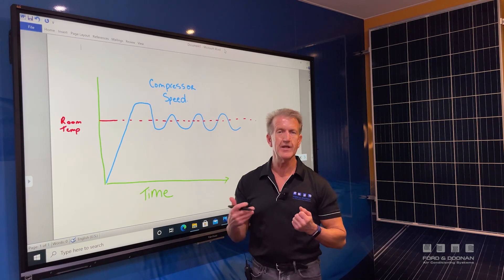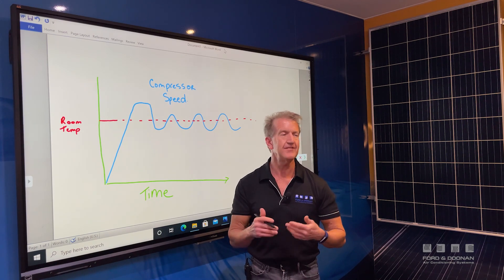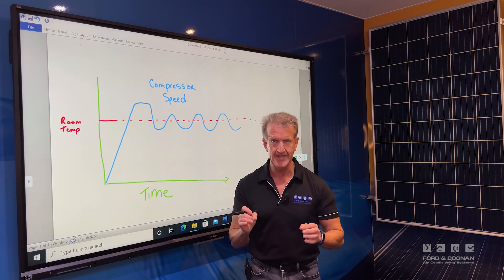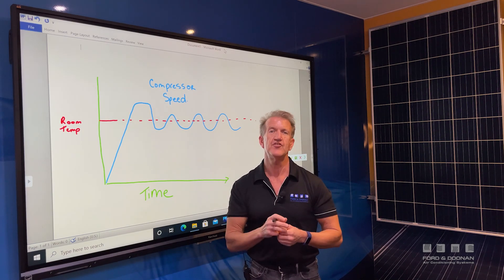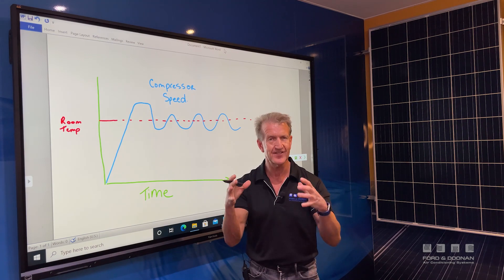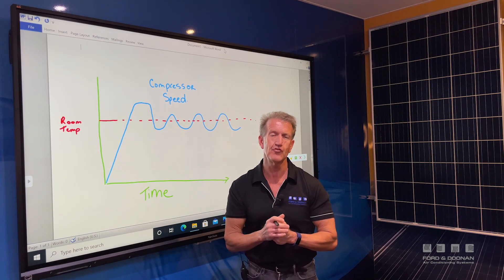The next question we often get asked is: what time of day should I start my air conditioner? Let's assume we know it's going to be a very hot day — 38 degrees, really anything above 36 degrees. What isn't fair on the air conditioner is to come home from work at 5 or 5:30 and then expect it to bring conditions down to comfort within half an hour. That's just not going to happen because the house has a lot of thermal mass of heat stored in the brickwork, and that won't dissipate in a very short time.